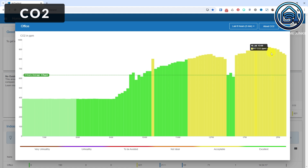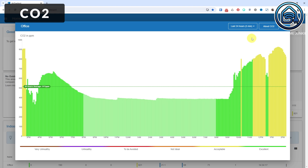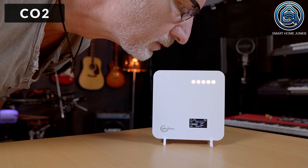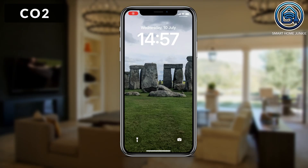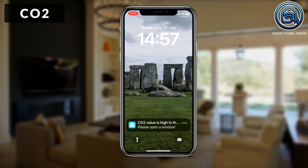Because of this multi-sensor, I have started to delve into the world of air quality and can now continuously monitor it. You can monitor the following values with the Air Gradient 1. First, CO2. Carbon dioxide is a gas in our atmosphere and the outside concentration is at around 430 ppm. When we breathe, we exhale CO2 and thus the concentration can increase in occupied rooms quite quickly. High levels of CO2 can cause headaches and also impact our brain's performance. To reduce the CO2 concentration, you can open windows or increase the fresh air rate of your HVAC system. By creating an automation in Home Assistant, you can send a message to your phone or smart speaker when the CO2 level is too high, so you can open a window. And if you have automatic window openers, you can even automate this entirely.